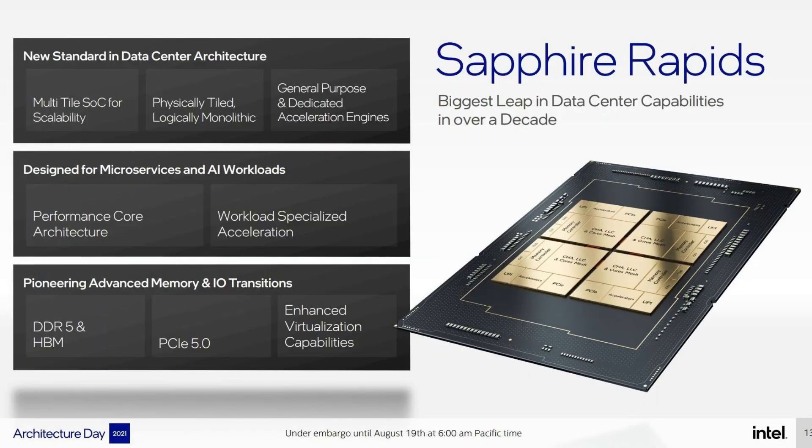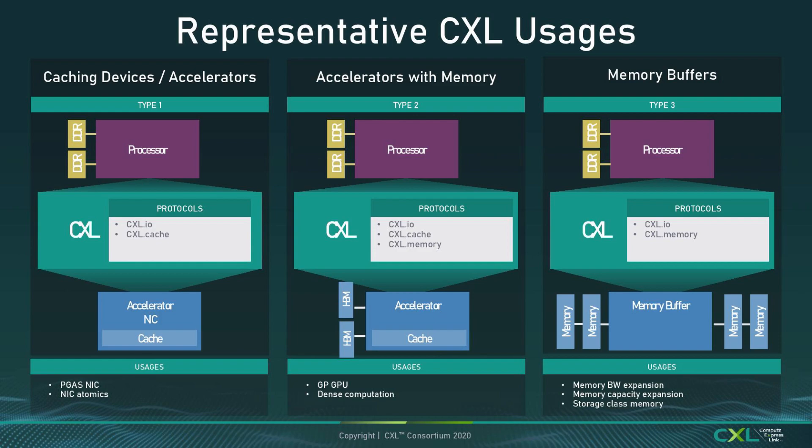Overall this chip provides eight 64-bit channels of DDR5, some amount of PCIe 5, and also supports CXL. However, what Intel didn't say at Architecture Day but did mention at Hot Chips is that CXL MEM — the memory standard for CXL — is not going to be supported. So it's unclear whether this constitutes full CXL 1.1 support. That's going to be an interesting one to see how they market it. CXL is still a nascent technology, so we're not expecting many devices built on it just yet.